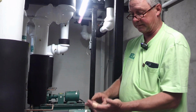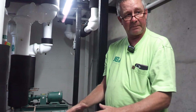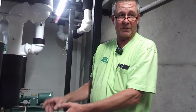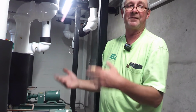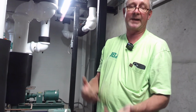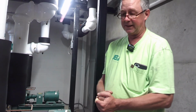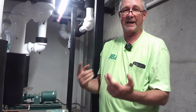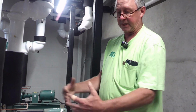The other thing I do is get some grease and grease around that. That holds the gasket in place. That way as you're putting it together, if you're not paying attention, again, if you pinch that gasket, you're toast. You got to find another one. Means you probably have to buy another kit, because there's like 12 different sizes or 14, whatever it is. Only comes with one of each. So if you pinch that gasket, you're done until you get another gasket. So be very careful. The grease helps hold it in place.